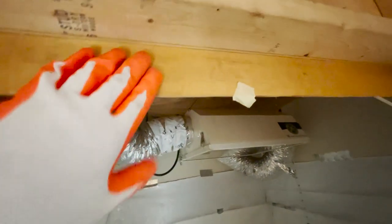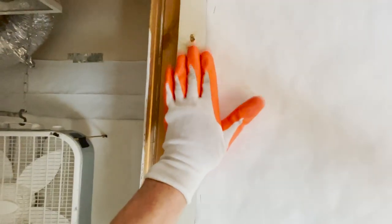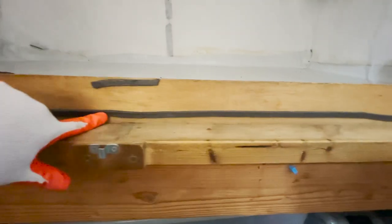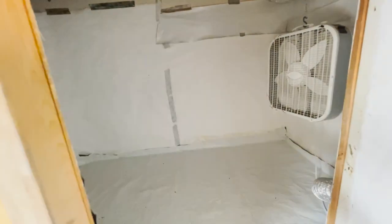Let me show you the three-inch overlap. If you want it light-tight, have a plywood strip covering about three inches all the way around. When you close it, it completely covers the edge. Add weather stripping right here and that makes it completely light-tight. This door is hollow — just two two-by-fours and hollow for 24 inches. That's all you need, very lightweight.